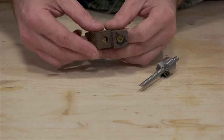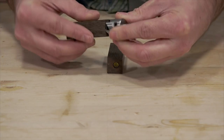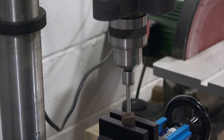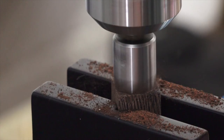You'll use a barrel cleaner pen mill in the drill press. This will clean out any glue that got into the tube and at the same time square up and flush the ends with the brass tube. You'll want to drill all the way down until you see the brass tube. Repeat this on each end of both pieces.